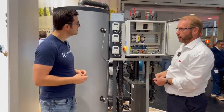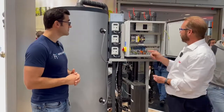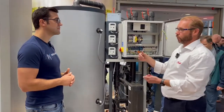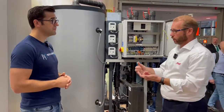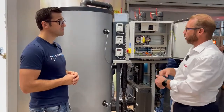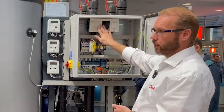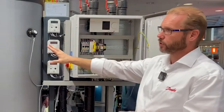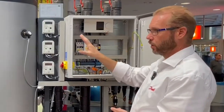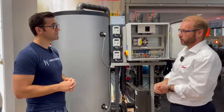This is a controller taken from our heating department — it's the ECL 310 — and this one maintains the water temperature inside. This water you can use for cleaning if needed, or for heating your building. If the temperature goes down, this will send a signal to our pack controller telling it to raise the pressure in order to heat up this tank.